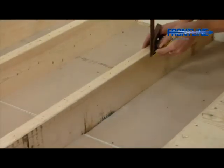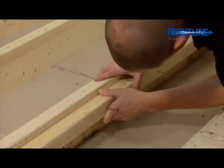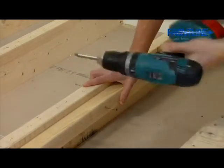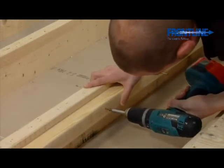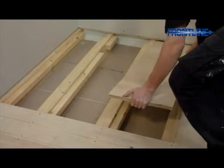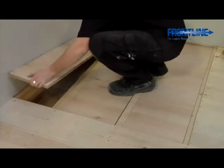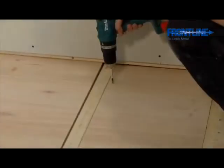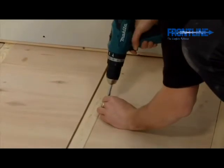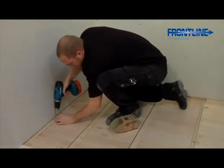Using an adjustable square, mark 18mm down on all joists. Then fix 2x2 battens to both sides of all exposed joists as shown. Cut to size and insert some 18mm marine plywood between your joists to create a solid floor at joist level. Securely screw the 18mm boards down apart from the board that is underneath the waste position, as this will need to be removed at the next stage.